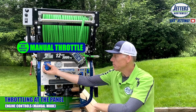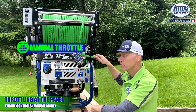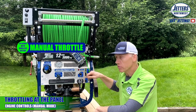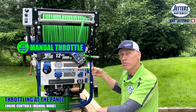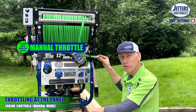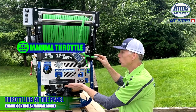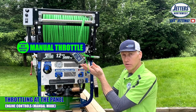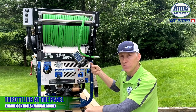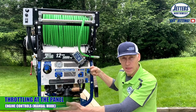Now controlling pressure — we have a pressure regulator here, but if you're running on the main jetter hose with a nozzlette on the end and you're not running a mini hose, you can pretty much control your pressure with your throttle up and down. Because as you throttle up, you're bringing more water to the nozzle. The nozzle is the main point of resistance that creates pressure, so the more water we put up against that nozzle, the higher the pressure becomes. The easiest way to adjust pressure is with your throttle — throttle up for more pressure and more flow, throttle down for less pressure and less flow.